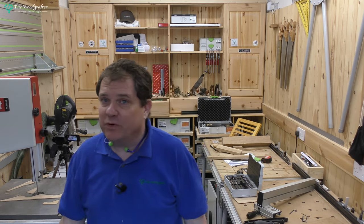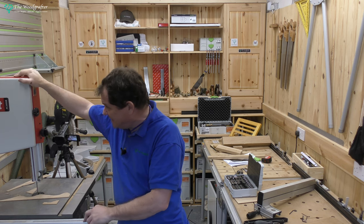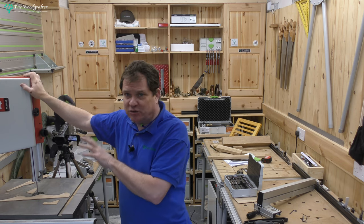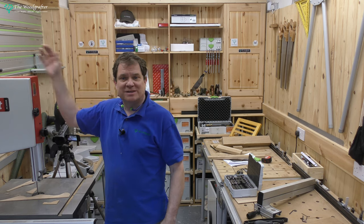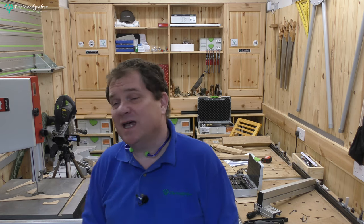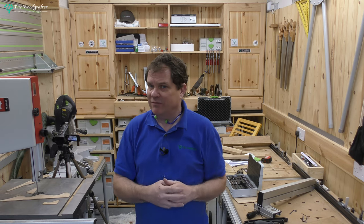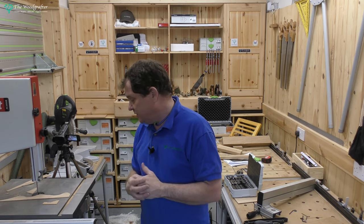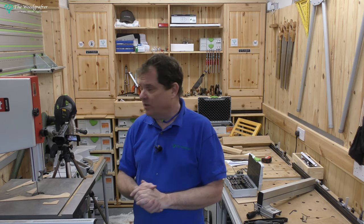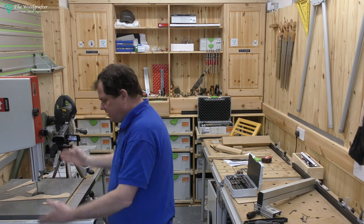More importantly, it does the job that I bought it for. This cost me somewhere around about £700 in the UK, and that was in 2020. It's a craft rated bandsaw, not a professional bandsaw, so we need to bear that in mind. What we don't get on the bandsaw is a quick tension release, which can be useful for the rapid changing of blades. But as we saw, it only takes about 10 minutes from decommissioning the blade all the way through to getting the thing calibrated ready for the next cut. We've seen it cut right down to one millimetre veneers with a level of precision. It can do the 45 degree cuts - and actually multi-angles between 0 to 45 - and it handled that incredibly well. It's got a good depth of cut, about 200 millimetres, and it's got a nice solid stable table.